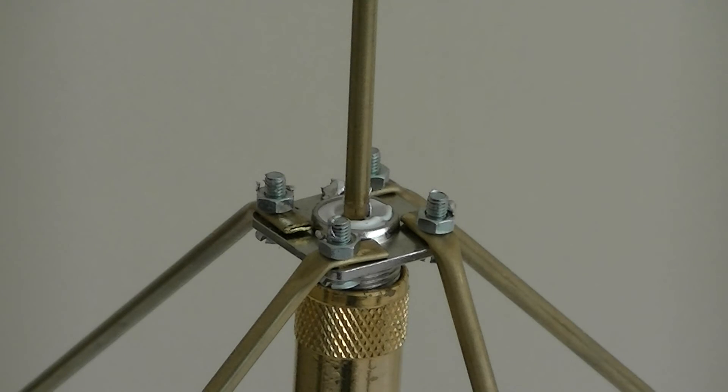With that I compressed them and decided I'd try and put the bend in them to make it work. I had to drill into the brass — drilling into brass is tricky because the brass is slippery once you compress it flat. That took a bit of time. The total came to mounting all four ground plane elements on the SO239 for the negative. The first two were great, they bent quite well. The next two weren't flattened enough and let's just say they broke when it came to bending them to the 45 degrees or so.